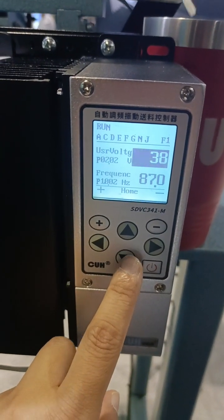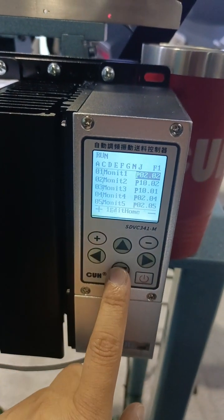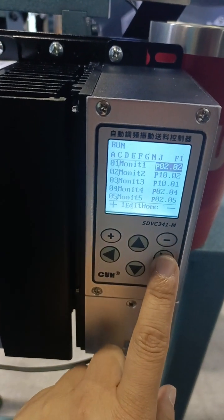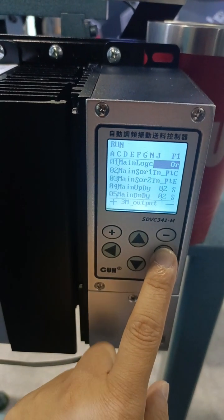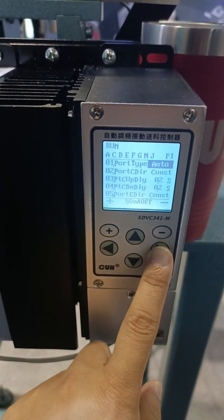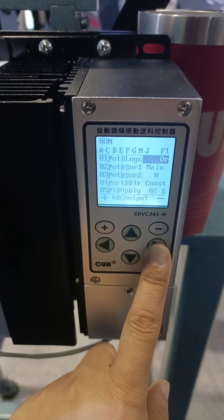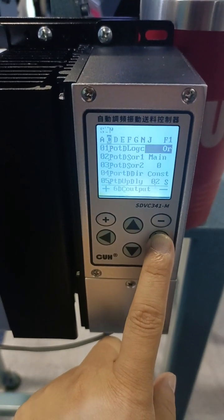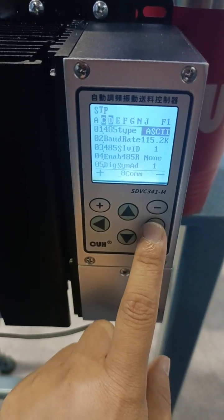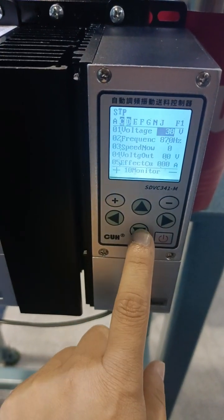And by this sensor, if you press, it has 10 groups. The third is for the output, the fourth is for the stabilizer of the feeding speed. The fifth group is for on-off of the signal of port C. This is for DC output, the 24 volts DC output. This is the counter. Group 8 is communication, RS485 communication. Group 9 is safe. 10 is monitor.